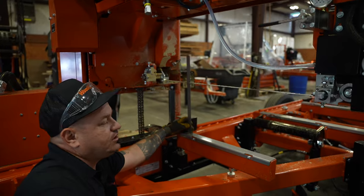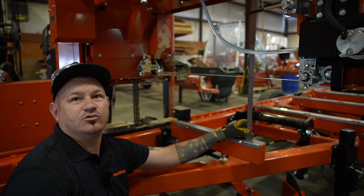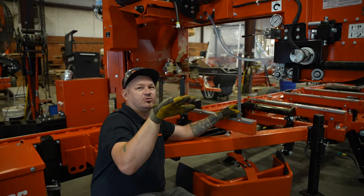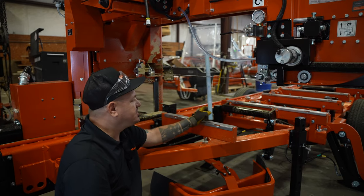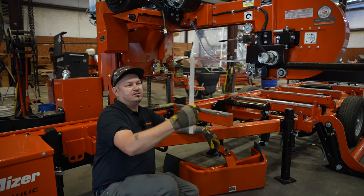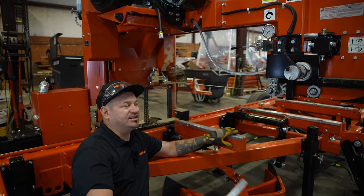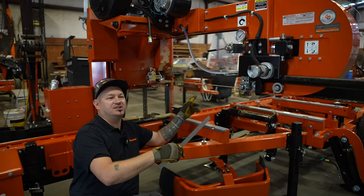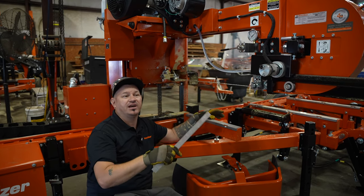See how the bottom tooth is touching 12 there? Over here I've got a 1/16-inch rise — that's normal. I want 12, 12, and a 16th. Even on the 15, the saw head torques down because it's calibrated, and that makes it cut 12 all the way through. So this first bed rail looks right. But let's say it was wrong — 12 and 11-something. I don't change it yet because I don't know: is that problem in my saw head tilt or in the bed rail? So I go down to every single bed rail, measure it, and make sure they're all the same. That's what I need first.